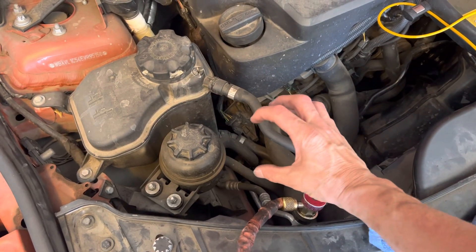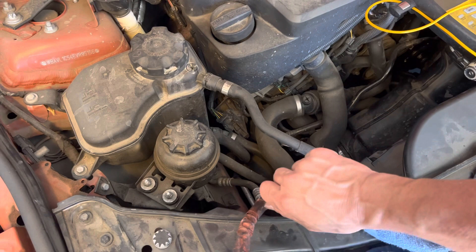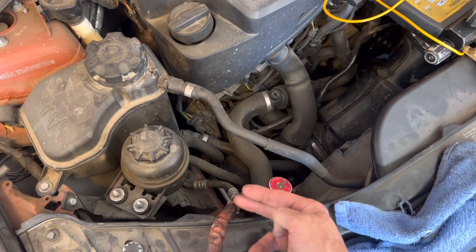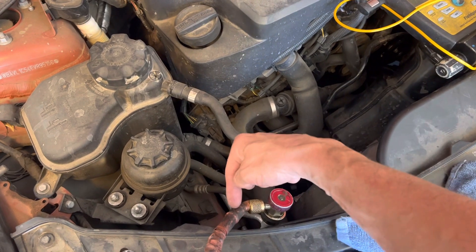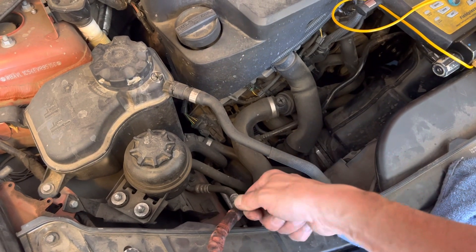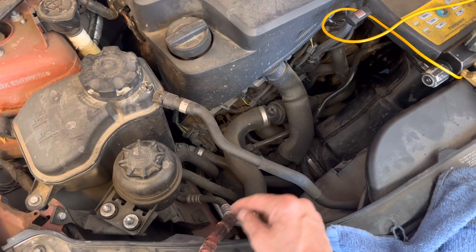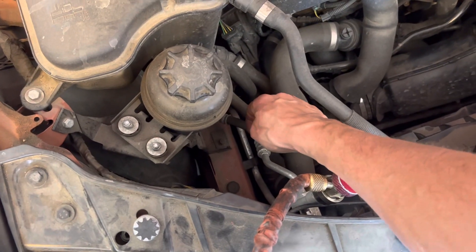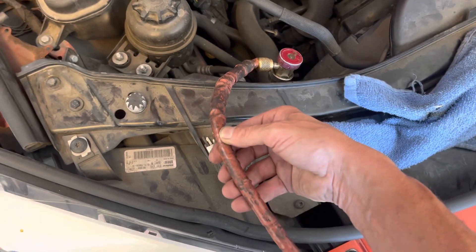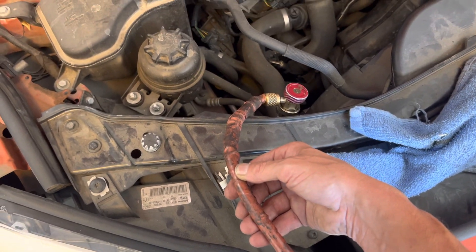You use an individual micron gauge tapped off that you can valve off. So you cut off your hoses, seal them up, and your micron gauge is located at the other end of the ball valve with no hose. So you're only reading the pipes and the hoses of the system — you're not reading the decay of your refrigerant hoses.